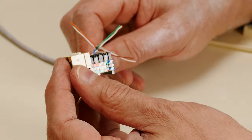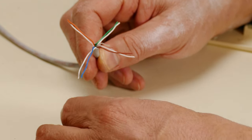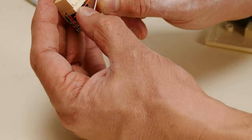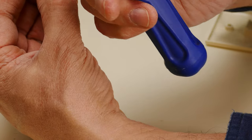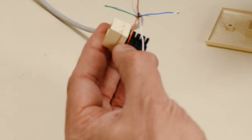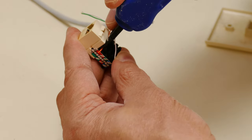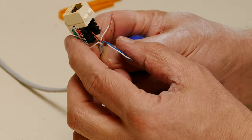Let me put it up close so you can see what I'm talking about. Follow the colors — the furthest ones in are the ones I do first. Orange and orange-white are all the way on the first two slots. Take the orange wire and slip it in between the little teeth — you'll see the little blades inside. Push it in with your finger slightly, then use the punch-down tool. Be careful: one side has a cutter on it, and the cutter must be on the outside. Push the wire down into the slot all the way through until it cuts off the wire — when it's seated properly it will cut off the wire. The end of the wire falls off, and then we bend it towards the middle.